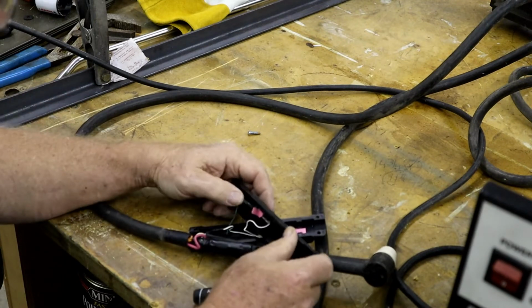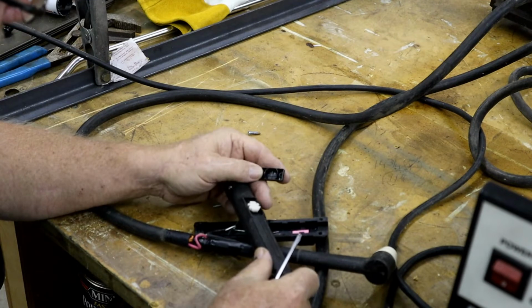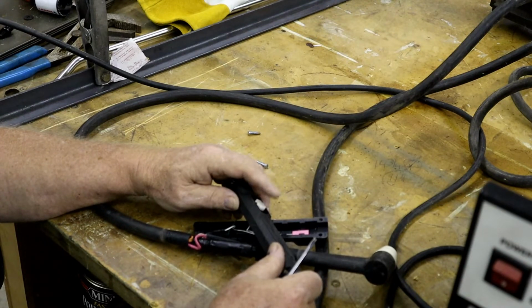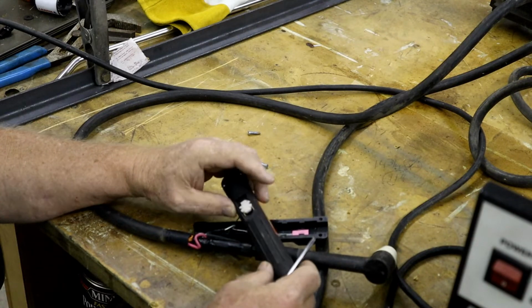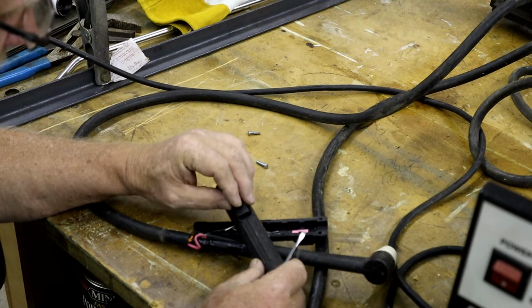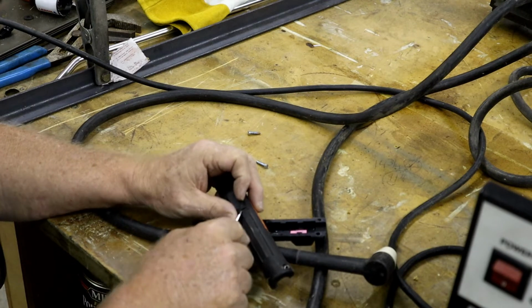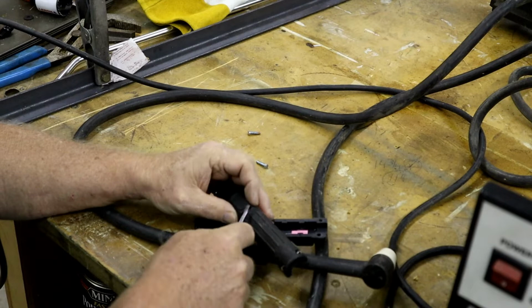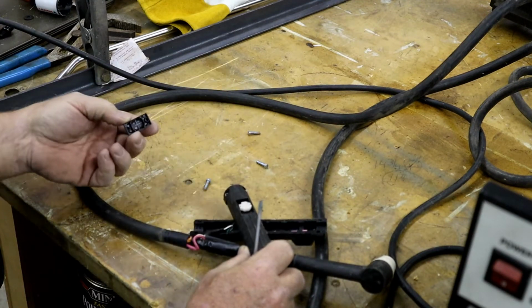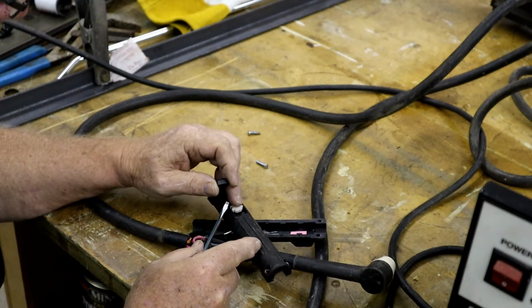Pull the switch out. I don't know if it's got a cover on it or if it snaps in place or what. Aha. That is rebounding nicely. So I suspect it's binding here on the side somewhere. Yep. For troubleshooting purposes, we're going to leave this off. May end up having to sand a little bit around here and find the spot that it's touching all the time, but I can make it work just like that.